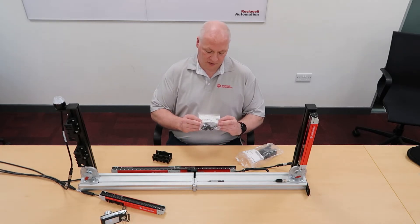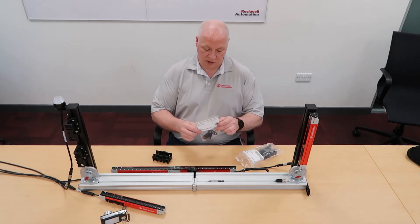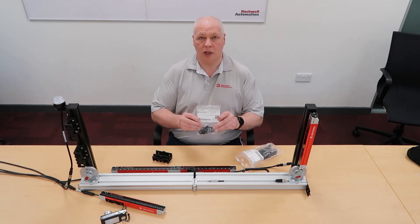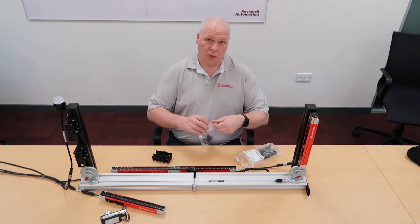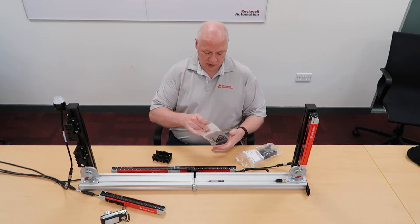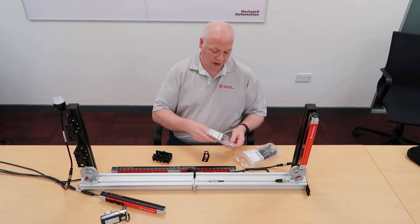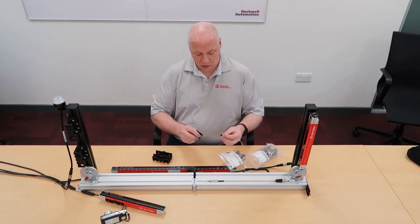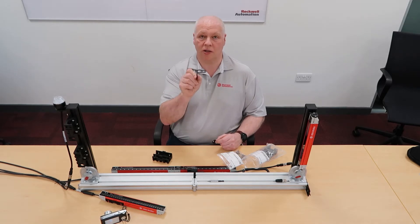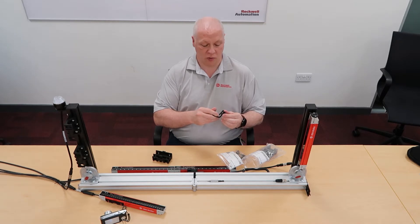The other bracket is the 450L-AN-TBM, which is the top-bottom mounting bracket. This is supplied standard with every single 450L light curtain that's sold. It's important to note that, because I still see a number of quotes requesting prices for this — people don't seem to realise it comes as standard. It's a two-piece construction, a 90-degree bracket with a little rotating part on the top.